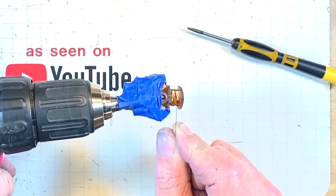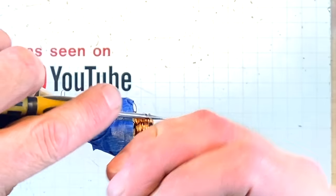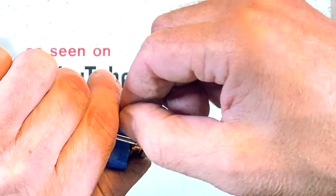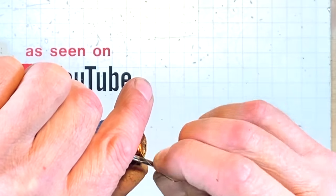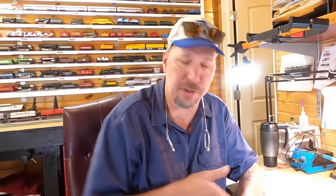We got her started. I'm going to tie this off, hold one round up, pull it around, put it through - kind of like the first part of tying your shoes. Pull it tight. Now we need to solder the commutators on. This wire we're using to wrap the motor with is called enameled wire or mag wire. There's a thin layer of insulation on the outside that keeps it from shorting out. If it was bare copper wire, you'd wrap it and the juice would just be almost a dead short.